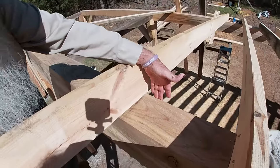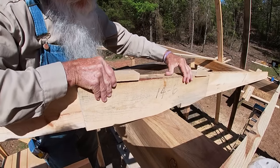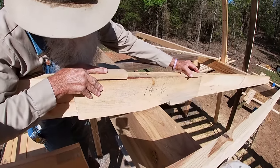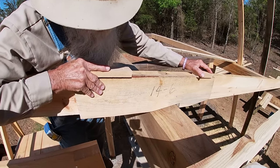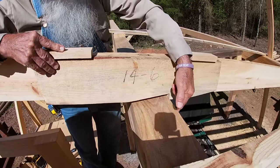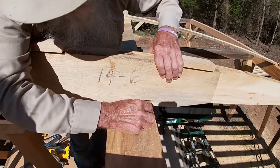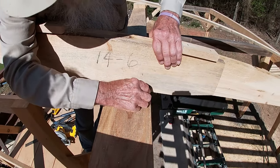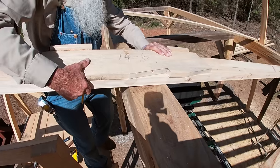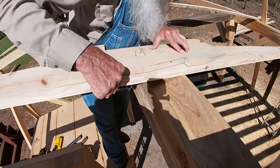This inside of the beam is actually our control. I've got my little catch pieces there, and I can just bring that up to where it just touches the beam on the inside of the beam. And I'm taking my pencil, and I'm just making a little bitty mark there. Then I can just lay this right over, and we drop the square, and I can finish my mark.